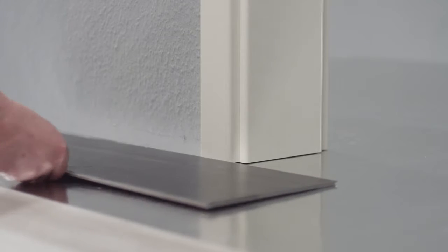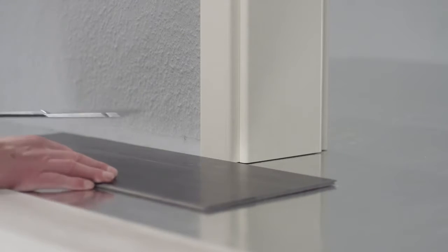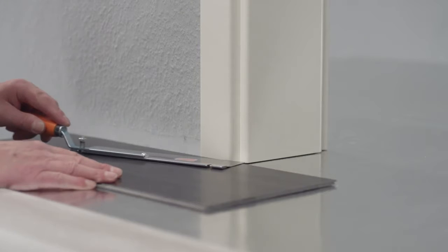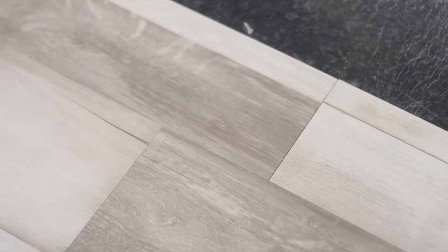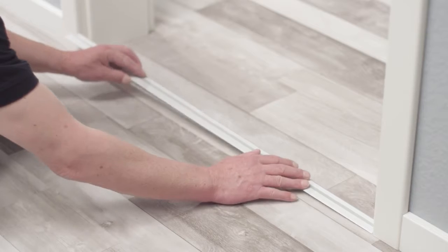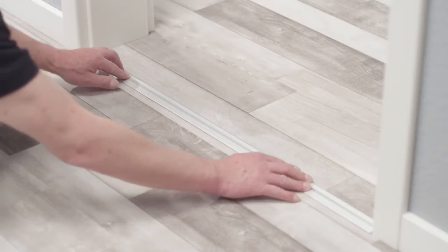To finish you can use pipe covering. Where necessary simply shorten the door frames too. To achieve the right height simply use a leftover piece as an underlay and a sharp saw. You can't lift the plank as usual here — push it in quite simply via the long side. An expansion joint is necessary in door transitions too. For covering purposes fit appropriate profiles.